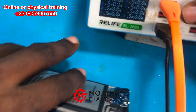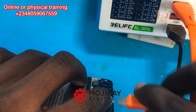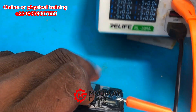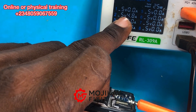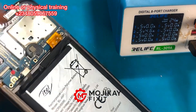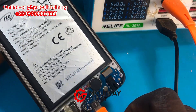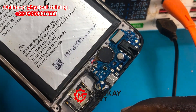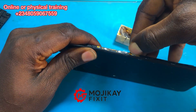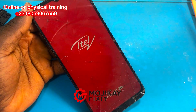Pay close attention at the charger. I'm going to insert the charger right now, and you can see it went straight up to 4.9, 5.0, 4.8 amps — which is very very dangerous. This should not show on your charger meter, and the phone is smoking. This phone can blow up if I had not removed the charger.